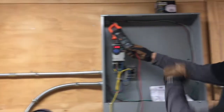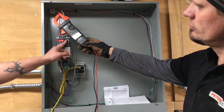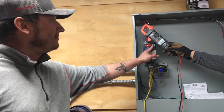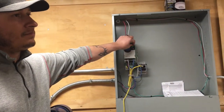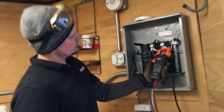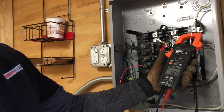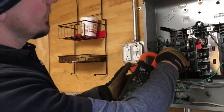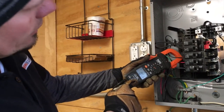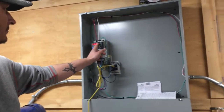As we increase the Hertz, we increase our amperage. When you have it maxed out, it's only seven and a half amps — that's a couple of coffee pots if I'm not mistaken. So if you max it out, most of the draw is just the motor. We've got about three amps for the lights, so total amps is about ten — three plus seven — because my lighting right here, eight feet of it, is only pulling about a half amp with the sensor. As you can see, it's very efficient for what they need to do.